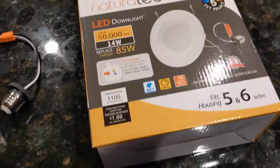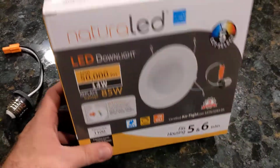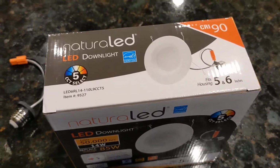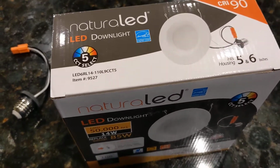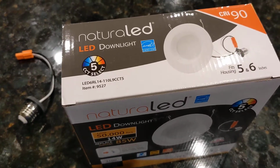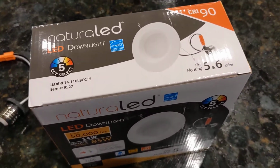And the other thing I wanted to do was install probably a 3000K bulb, and 3000K, that's color temperature. 3000 is a little whiter, but it's not really harsh. When you get up to 4000 or 5000K, it's very harsh, bright white light, which is great in some situations, like an airport, but it's not so nice around the house.